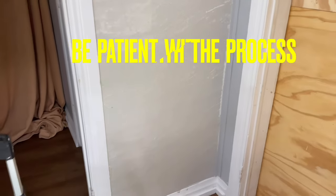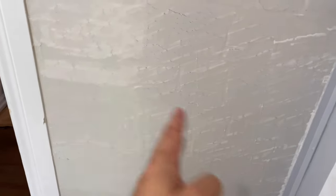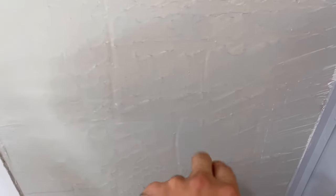I'm going to apply a second coat of mud the same way I did, but all sideways this time — from left to right or right to left. Here is the wall. I'm back after a second coat going sideways from left to right and right to left. It's looking a lot better. There's going to be small areas — you can see where these are still sticking out ever so slightly. Whenever I go top to bottom again on my third coat, that'll fill these in.